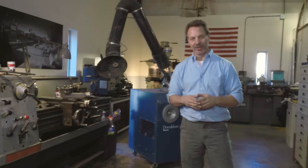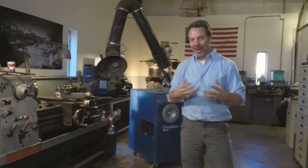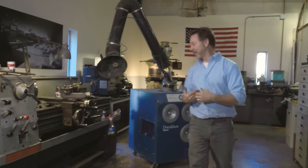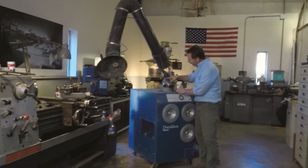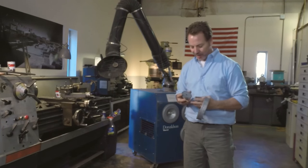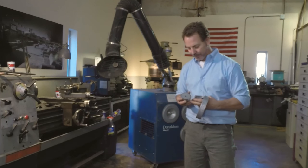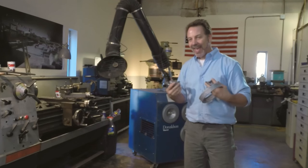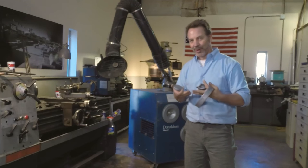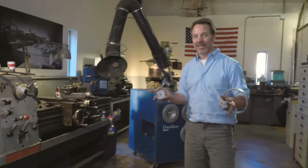Hi, my name is Dale and welcome to Metal Tips and Tricks. I want to talk to you about welding aluminum today and how easy it is to get it done. I've got a fume extractor back here — actually got two of them — and I'm sending one down to Adam Booth, but before I can do that I need to fix something. There's an elbow right here where it broke, and this is a part that is cast aluminum. Aluminum itself has its challenges: it has an oxide layer that melts at a much higher temperature than the base metal, and being cast aluminum means there are different types of particulates that bubble to the surface and cause inclusions in your weld, which means it could crack and break again. So these things all have to be taken into consideration.